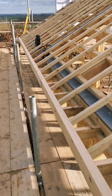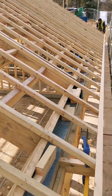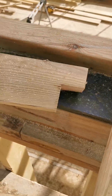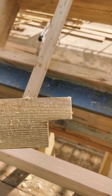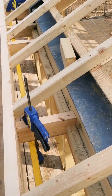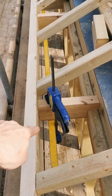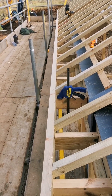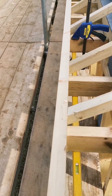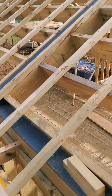For the soffit, usually I'd put a timber along the back, but we're doing this differently. We've got our backing board going up — six by two hanging down off the two by two. So we've laser levelled a bit of timber along the back, set up a guide on a skill saw, and took two cuts out to get a perfect square. We'll put them in to take the weight so we can fix up. Level across, get one in, do one a couple of metres long, clamp it levelled across, then fix them in. That holds it square, takes some weight and pressure — giving us a nice solid fascia and soffit setup.